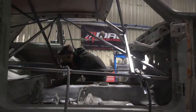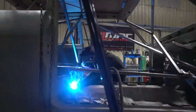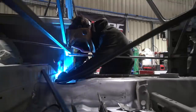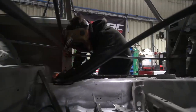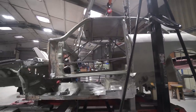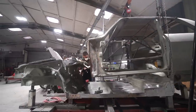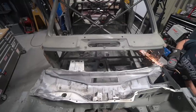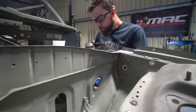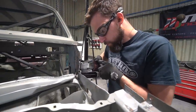There's a couple of mounting points here, a couple up there, and a couple in the back tying into the old rear seat backrest mount points - that just gives us a repeatable point to work to. And then Scott's been doing some of the further modifications, trimming some more sections of the Honda bulkhead. He will be trimming out some more sections of the Allegro. We're going to be taking out the original dash backing area. The new dash going in this car will have a lot of nods and possibly some of the original components of the original Allegro dash.